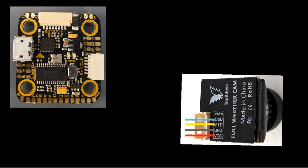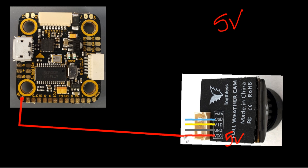Right now we're going to be talking about the FPV camera. Most of these cameras take anywhere between 5 volts all the way up to 30-plus volts, but I really recommend you set it up on a 5-volt regulator. This reduces the chances of getting some weird lines or flickers in your video feed, which can hinder your flying performance. We can grab our first 5 volt right at the edge there, and that would give our camera 5 volts.